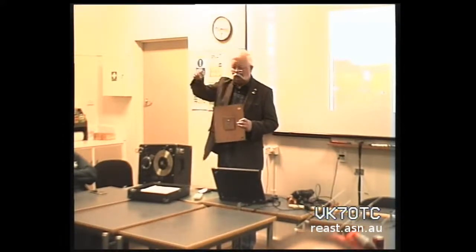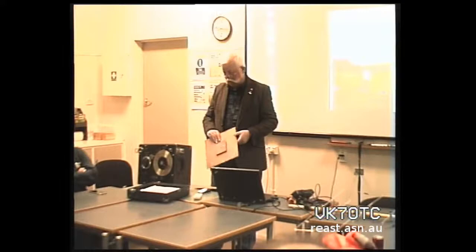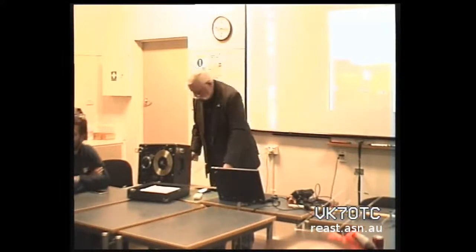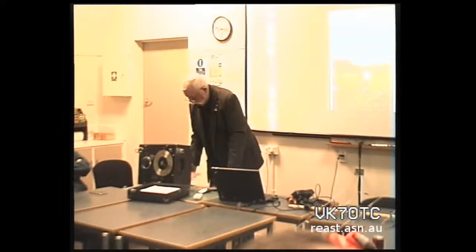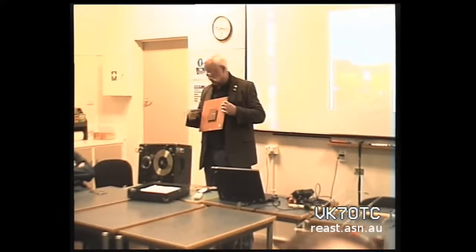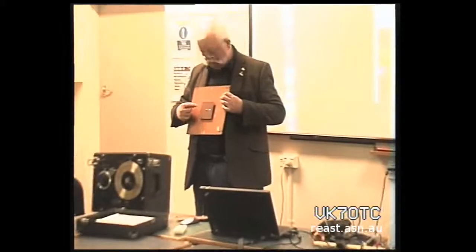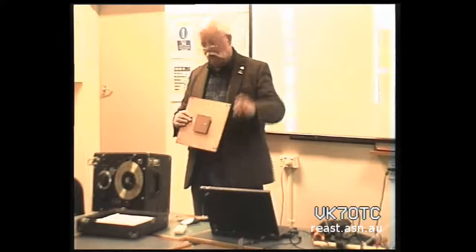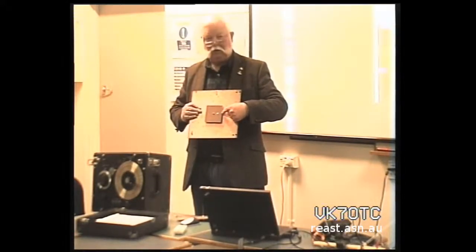The disadvantage of the high gain Yagi is that it gets narrower and narrower and narrower the more gain you pop into it. Especially when you've got a 6 meter one. Hey, Richard. One of the things you can do with this, because I've got like a 6 meter one, is if you want to go up one band, all you do is add another panel on here and feed that through. Another thing you could do is that's where 50 ohms is, that's 200 ohms.